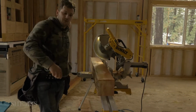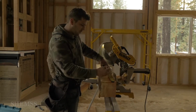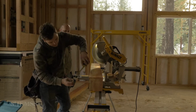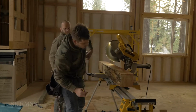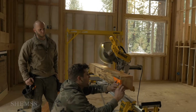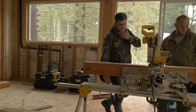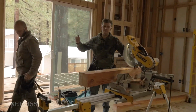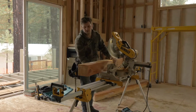So to notch it, we'll mark the height of the joist, which is 7.5, 2x8. We'll mark it, and we want to leave 4.25, which is our gap width. Just gotta mark that, and we cut out this. Boom. So there's a lot of ways to notch it. Been doing it for a long time, and my favorite way that I've learned lately is with a chop saw.